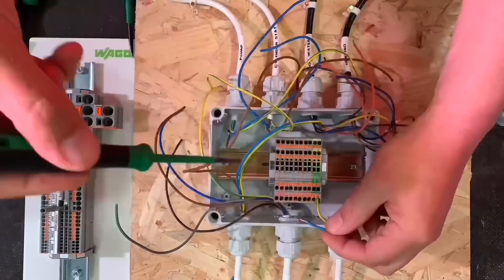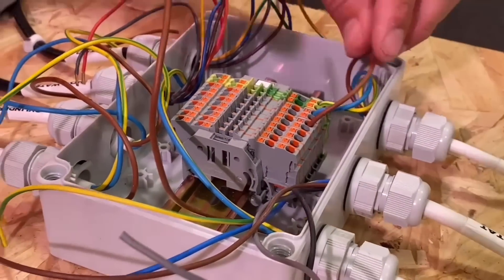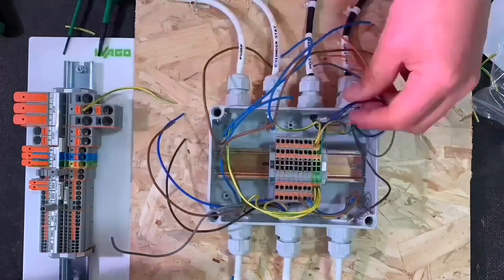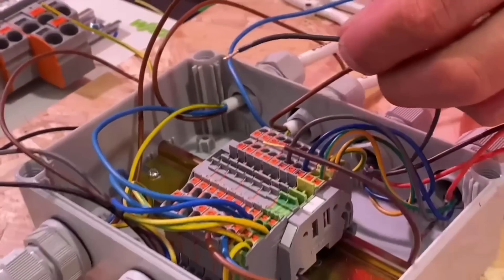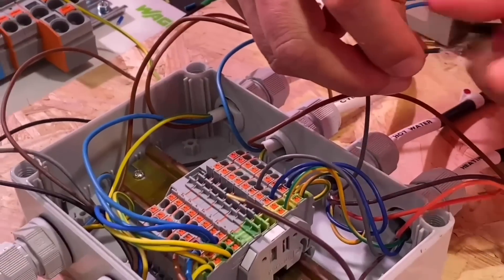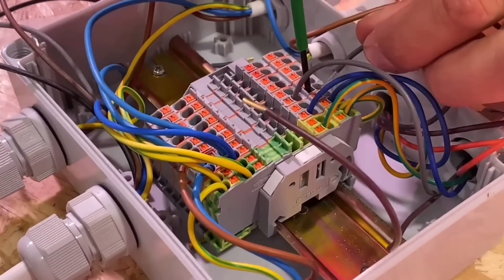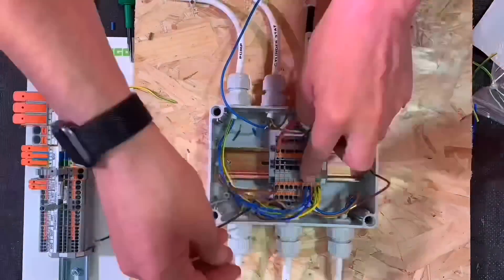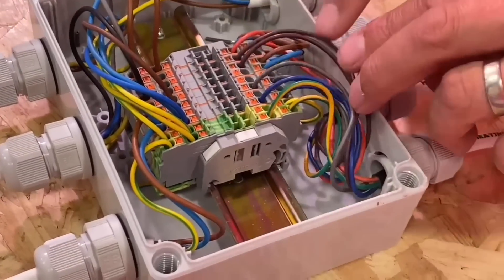Just build it up, cap on, and then start a little bit of wiring. So using the push variety of these — we've got the ones that use the operating slot and we've got the lever type, to make your connections onto the DIN rail terminals from Wago. That's easy for anyone who descends into an alien world and doesn't know what they're looking at — the little push button is very easy to work with. These are Class 5 stranded conductors; you don't even really need to twist them to put them into the Top Job terminals. Just use the operating tool, drop it in, connected. I'll jump back in when you're on that last final connection. So there it goes — last one's in place.